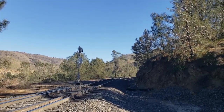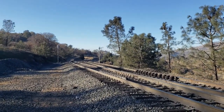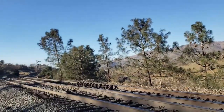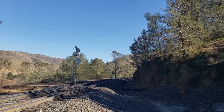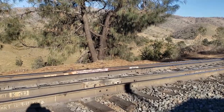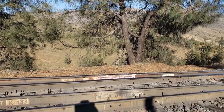Could there still be issues at places like this? Yeah — if somebody were to get their train by a red signal, even with PTC, if they were cruising up the hill at 20 miles an hour and ran that red signal and a guy was coming down here just around that curve, he'd knock that signal down but they still might not be able to get stopped in time to avoid what they call a cornfield meet. Also, since polarity joints have opposing polarities on each side, if one of those joints fails it knocks the circuit down and you have to come out and figure out why — it may have to be changed.